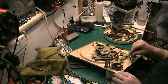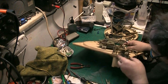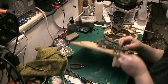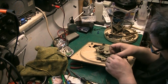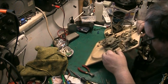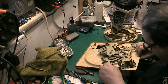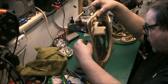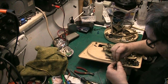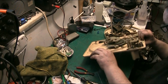Is that roller there seized? Yeah, that's a bit gummy as well. That's a bit of what we're looking for — and that connects to this bar here, it connects under. So I can take this off at this end — it ain't going to come out of that end. There we go — take that off there. There we go, and this can all be washed. Now the tonearm — removal of the tonearm is achieved by undoing the grub screw here. And there are bearings in this one — I'm sure there is. There's a load of ball bearings just fell out. Let's get my magnet.